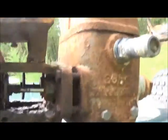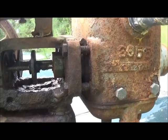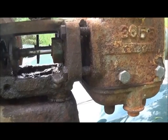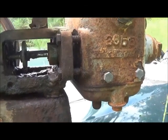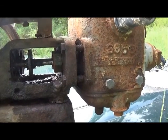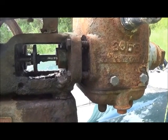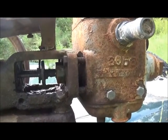What's different to me is that the cylinders, as you can see, are not 180 degrees apart. That's going to help with starting — it'll start no problem by itself without spinning it, and it would work well for reversing. But when it comes to the slide valve setup, we're going to have to run two eccentrics, two separate rods, and two separate slide valves.